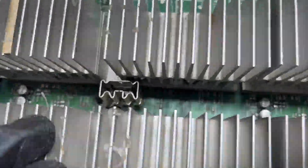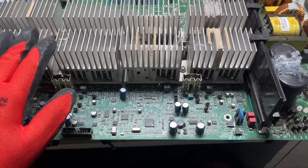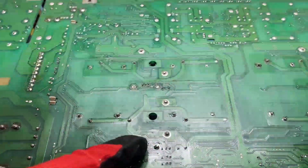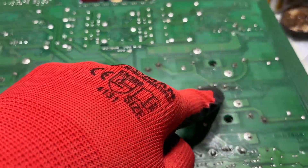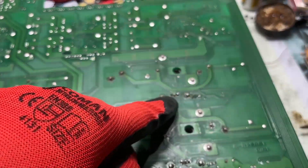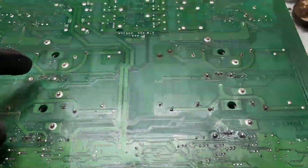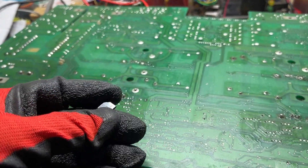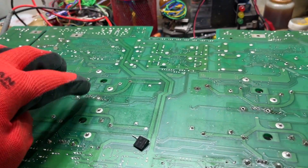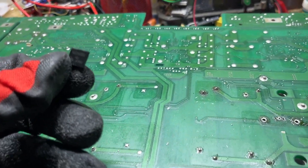After checking those I'll remove all the heat sinks and check the diodes. Let me flip it. So as you can see — this one, this one, this one, and this one — I'm checking these four transistors. And you can say I must be lucky: while checking these four transistors, I found one of them was exploded.